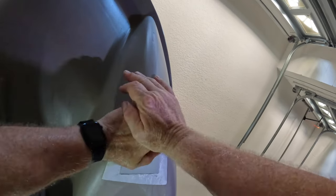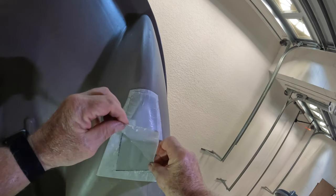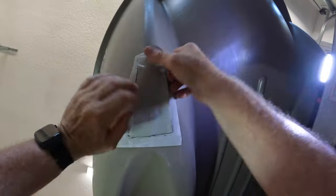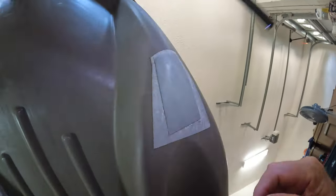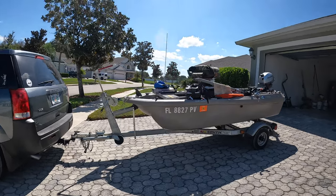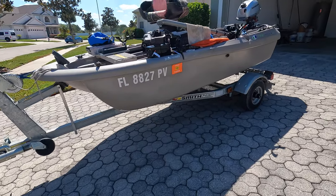I'm using the top membrane after peeling it off to avoid having it stick to my fingers — I use it between my finger and the patch to push it and get all the air out and make sure it's sealed tightly. On the starboard side it works exactly the same way, sticks extremely well to the hull and to the patch underneath. I immediately connected to the tow vehicle and dragged the boat and trailer out into the driveway where the sun would expose it. Even in that direct sun it hardens very quickly — it's now 1:27, about 10 minutes later.